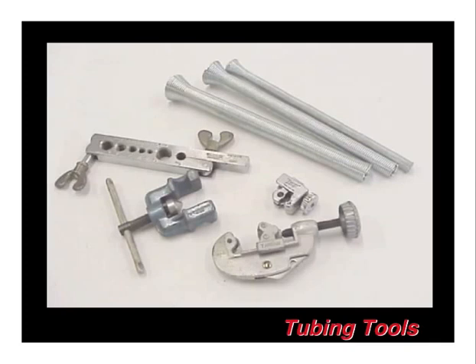These tubing tools would be used very rarely. In the upper right-hand side are some spiral sleeves that you put over soft aluminum tubing so you don't kink the tubing when you bend it — used very rarely. In the lower right-hand side is a simple tubing cutter in two different sizes, one very small and one medium, used to cut mainly steel tubing. For those of you doing your own welded components, this might be a very useful tool. On the left-hand side is a flaring tool you'll really only use once to do your fuel system — it expands the entry point of aluminum tubing for your fuel system so you can install fittings.